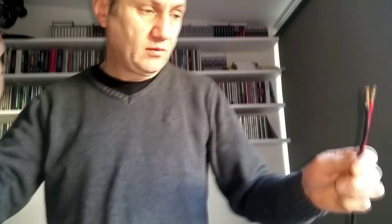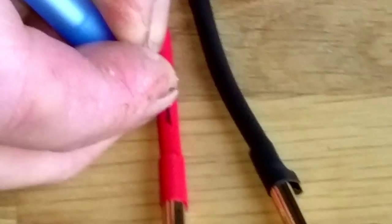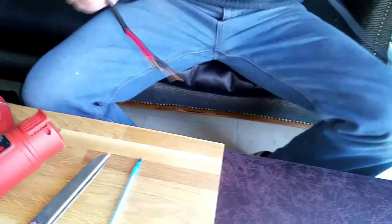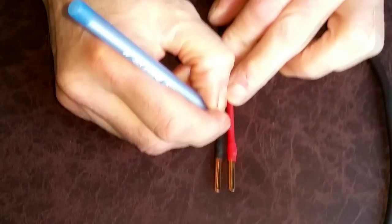Here's our speaker cable, 1.8 meters. We've heat shrunk the main body over and that's totally completed. Now we're going to indicate with a pen on the red one the speaker end — a little arrow there — so put a little red mark with an arrow. You do it on the red one so you know your signal flow. If you ever take it off, you don't want to turn it around the wrong way. And this is the second cable we made. Now we've got a whole complete set of speaker cables, so do the same thing — put the arrow on that one too.